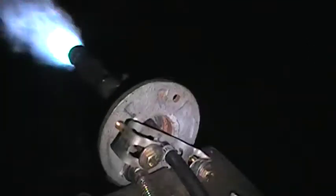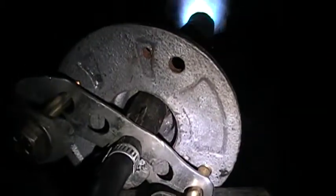And back here is the base plate of the burner. Base plate holds the supply line to a nipple, and then into the actual base where the jet is located. The jet is actually out of a grill. It's much larger than the typical sizes you see used in these applications.